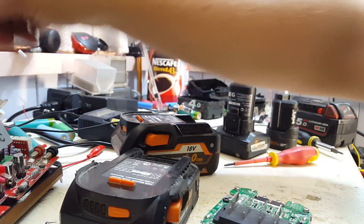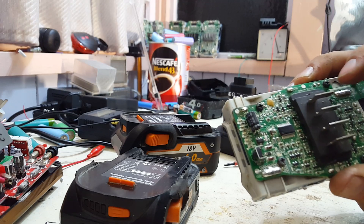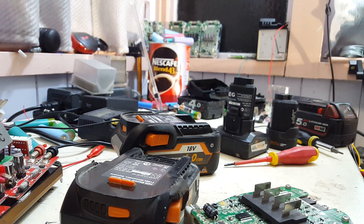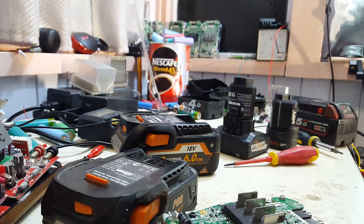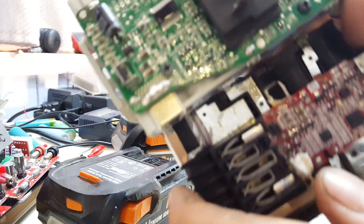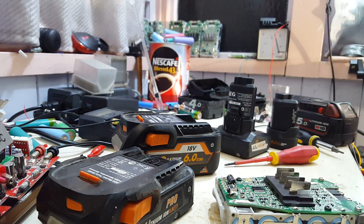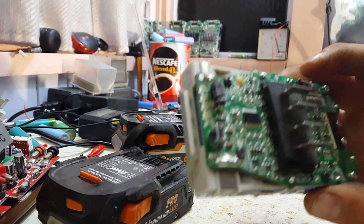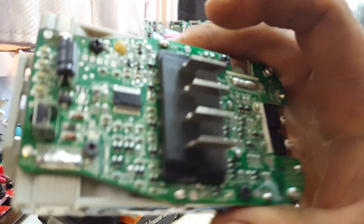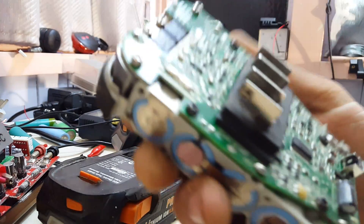All right, so it's simple — nothing too amazing about the actual cells. But the circuit board on them is quite complex compared to a Milwaukee. Here's a Milwaukee one — it's quite small and compact. As compared with this AEG board, on the Milwaukee one there's no big ICs and no heatsinks. That makes me think that the AEG charger is quite a dumb thing and it just bulk pushes charging on a separate pin, while this onboard circuit actually controls the charge and distribution to the cells. So it's like an onboard BMS.